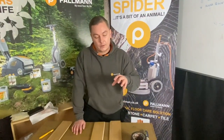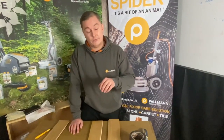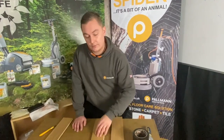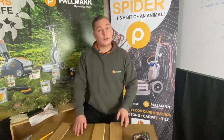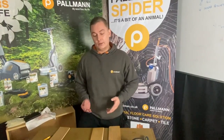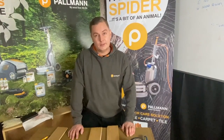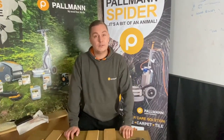As a contractor you'll be doing this test, but manufacturers are going to need it photographed and recorded. When you're doing this, I would photograph it with the date and also the batch numbers of the products you're using, because that could get you out of a world of trouble with manufacturers claiming products failed or if there was a problem with the timber. I hope that's helped. Here at Ultimate Floor Care we're always happy to help, so if you've got any questions or want us to do a video on something, just send us a message. Thank you.